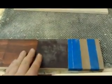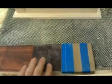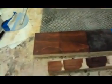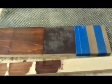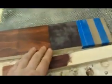So with that being said, I think what happened here was, in my hurry of getting this sealed last night before I left the shop, this stain wasn't dry enough. I know that it was dry to the touch, but it still wasn't dry for that hour that they say. The darker the stain, the more critical that hour is. I should have known last night that I was going to run a risk of this, but I didn't think too far ahead, and here is the proof.